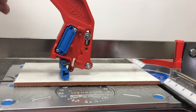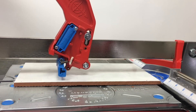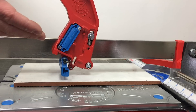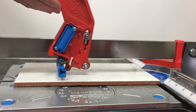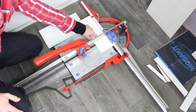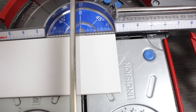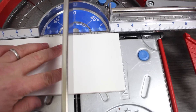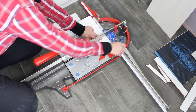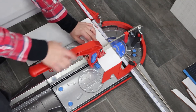The handle is self-adjusting, so you don't have to adjust it for different thicknesses of tile. The tile can be anywhere from a quarter inch to up to one inch and you can still use this particular setup. If you need to make a whole bunch of three inch cuts out of one tile, you just slide your tile over to the three inch mark, put this device right here, lock it in place, and you can score the tile and keep cutting one after the other.